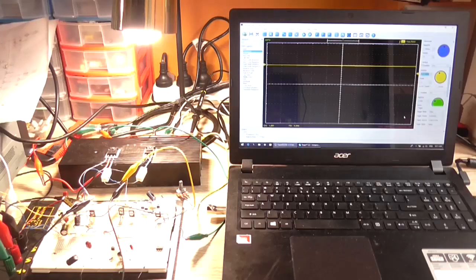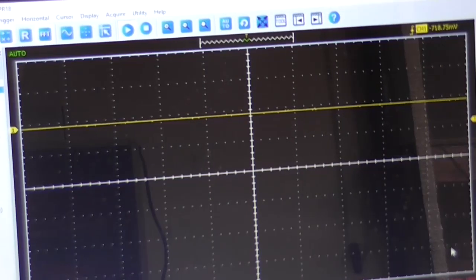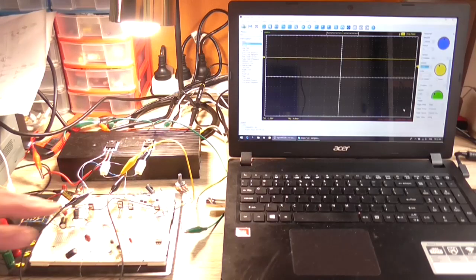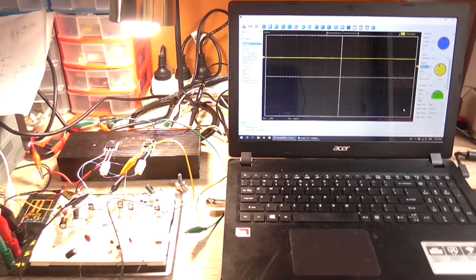Well, there are many reasons why an amplifier can have a perceived DC offset as represented on a multimeter in the DC scale anyway. And one of them, which is not thought about that much, is oscillation. So if I turn the load on with no input connected, all we see is just a bunch of random noise. Nothing really spectacular. The amplifier is not oscillating on any frequency that I can see anyway. So what does this mean? Not much, but that could mean that it's just poor layout. So anyway, let me change that gain structure.